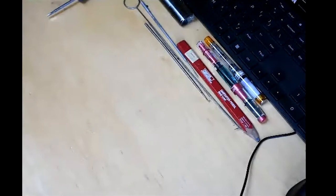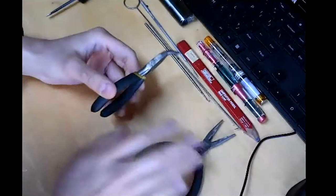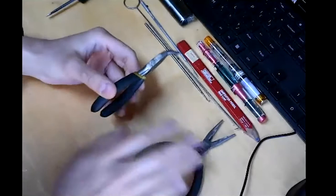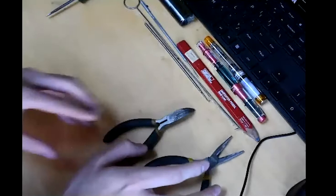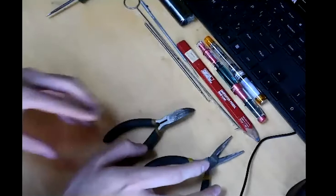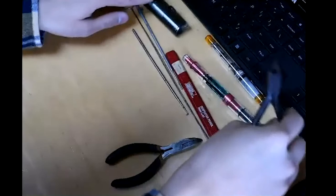Next is another conventional tool: pliers. These are standard needle nose pliers, and there are also 90 degree pliers — I use these way more than standard needle nose. I don't recommend bending them yourself, because heating the metal to make it pliable will ruin the temper. There are also wire cutters. You'd use these to modify links in your machine, or mainly for modifying springs inside the machine.